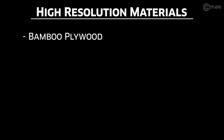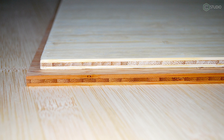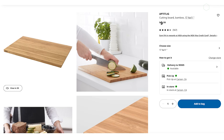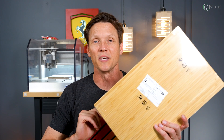Let's add in a plywood variant: bamboo plywood. This is high resolution only — put it in that category. It's many fewer plies; you're going to get three for a half-inch piece. The cellular structure of bamboo is wonderful for machining — it is extremely tight, it takes details. We make Nomad sides out of this for a reason: it looks outstanding and it machines perfectly. If you haven't worked with bamboo plywood, you should give it a shot. It's not the cheapest stuff, but it's not Baltic Birch. Search it out — you can find it at a wood shop, or go to Ikea and for $10 get yourself a blank. A $10 experiment to get an opportunity to experience this.